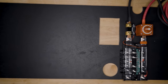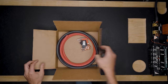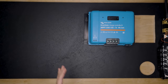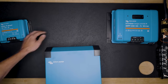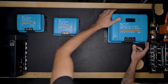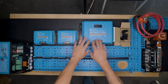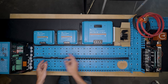Now let's talk about wiring for the next part of this install. For each of the components we're wiring up today we have a wiring kit to go along with each one that we've already wired up off screen. For this install we're going to be using the Victron SmartSolar MPPT 250/85 solar charge controller, dual Orion DC to DC chargers, and a 24-volt MultiPlus 2x120 for 50-amp shore power RVs - and everything is going to live approximately right here. We're using wire duct that we've pre-cut to proper lengths off camera, with a nice cover on top for good wire management.